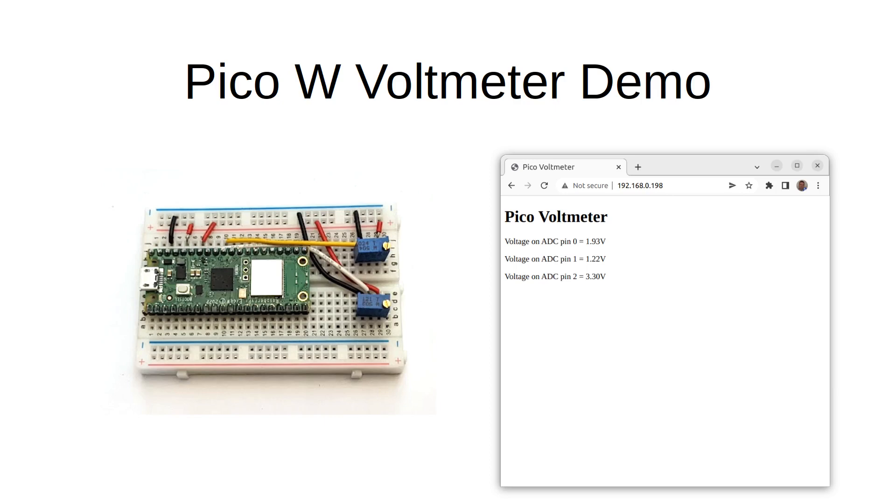For this example I'm creating a simple voltmeter. This is based on one of my first projects with the original Pico, which I combined with the Raspberry Pi. This makes use of the analog inputs on the Pico W. Note that these pins are only safe for up to 3.3 volts, so don't try and connect them to anything higher than that. This is only a very basic example at this stage — I hope to upgrade some of my existing projects to use the Wi-Fi and also create some new ones in the future.